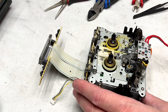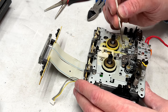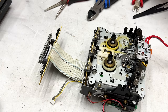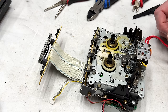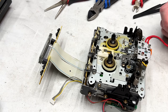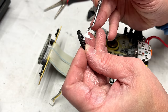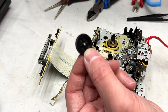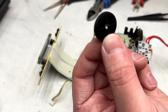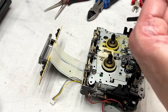And I'm taking a look at the grease as well. I don't think it needs replacing. No, it's fine. It's graphite grease, it looks like. So that'll stay good forever. At least I hope it will. But yeah, we need to reinstall the idler. There we go. That's the result I was looking for. Basically putting a little bit on to block the hole, and then I'll push it down on the shaft, and the shaft will chase the grease through.